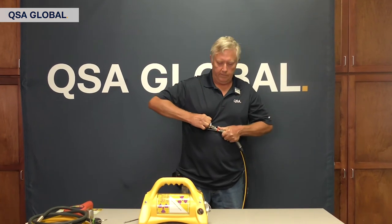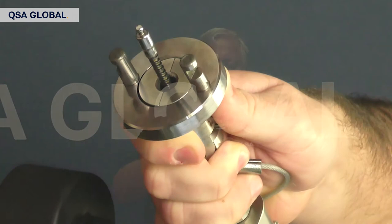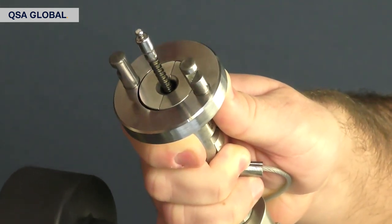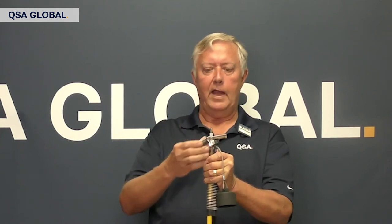I'll remove the dust cover at this point. Then I'll look at my collar — my pins are nice and square and not completely rounded off or showing any damage. Then I'll drop it down and we have the 661 flappers. The pins holding them in place are in the proper position and not backing out. They've made up well — no problems there.